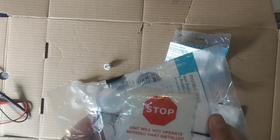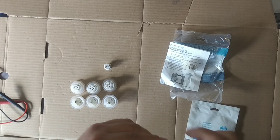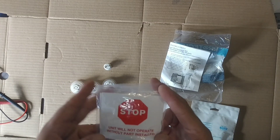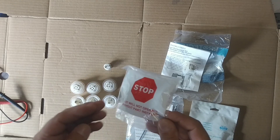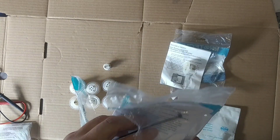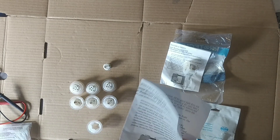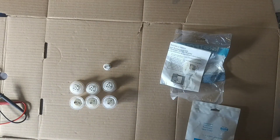I also got a brand new package here. This is from Rheem — these are the Rheem flammable vapor sensors. I'm going to rip open a brand new pack for you. I want to show you exactly what you get in the pack. This here, it's a pack within a pack — it's actually double-packed to prevent it from picking up any scent from any flammable vapors. You're also going to get a zip tie and the casing for it, because on the Rheem water heaters it comes with that weird plastic casing that actually saddles in your water heater. And obviously you're going to have the instructions — I would suggest you read them.